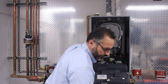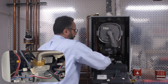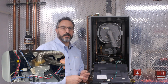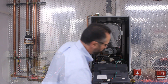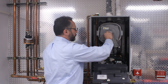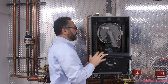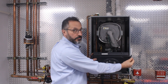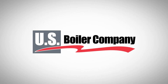Now that the nuts are secure, use the appropriate wrench to secure the gas valve nut. This is a negative pressure gas valve, so the nut does not need to be excessively tight. Once assembled, reconnect the ground. Fold the burner door up and reconnect the ignition cable. On the earlier models, reconnect the leash to support the door. We'll be right back.